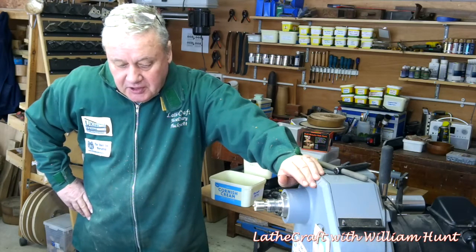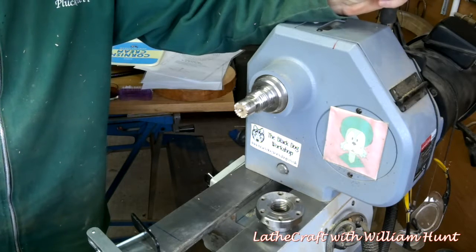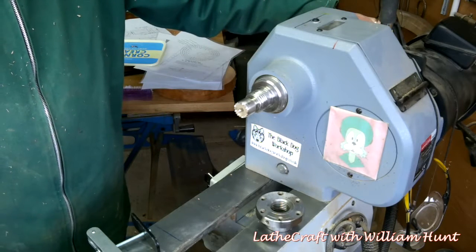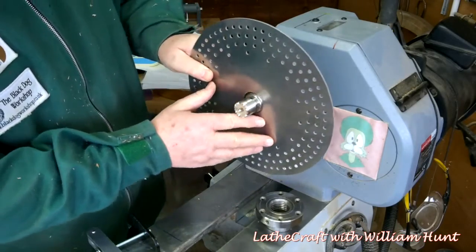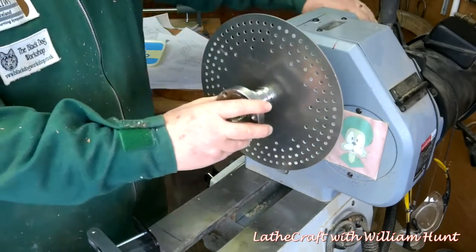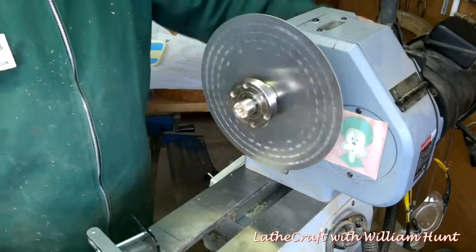We're out of the kitchen and into the workshop. I'll start off by fitting the index plate and arm to the lathe, because just about whatever you're going to do you're going to need that. Before we mount any equipment on the lathe, there are multiple warnings in Paul's instructions to make sure the lathe is switched off. I have switched mine off and unplugged it. Mounting the index plate doesn't present much of a technical challenge — it can be secured in place with a chuck or a face plate; in this case I'm using a three-inch face plate.